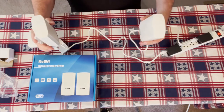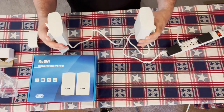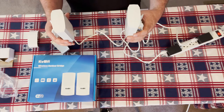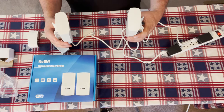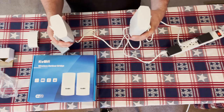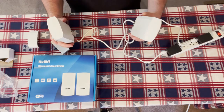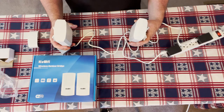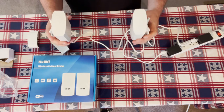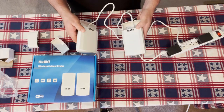Right out of the box these units are pre-configured to communicate with each other and can go up to 1.8 miles line of sight. We've tested these at about three-quarters of a mile line of sight and got 450 Mbps. They advertise 900 Mbps but I've never seen that, and it's not uncommon with bridges — as you increase distance you lose throughput, which is to be expected. These are 5 GHz, so they won't penetrate forests or steel walls. They can handle a little foliage or shrubbery but nothing thick.